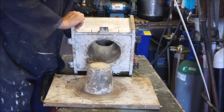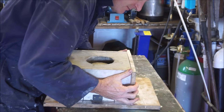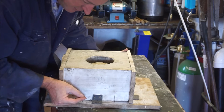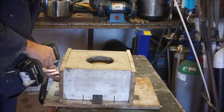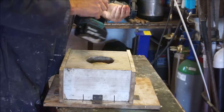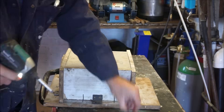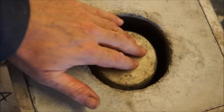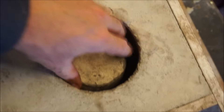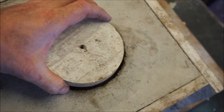So that's the centre of the mould. This goes over like that — it's located with some screw holes. I'll just screw it down. So there it is ready. That's the inner section and that's the outer section, and you just basically ram the grog and clay mixture into that. Then I put that on top and push it out so it demoulds.